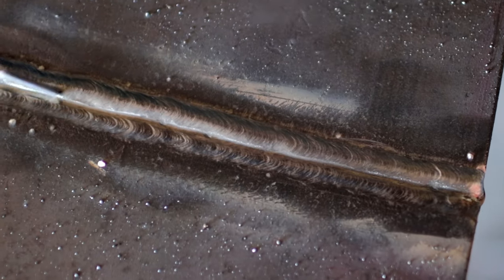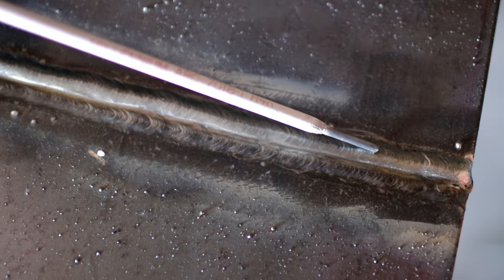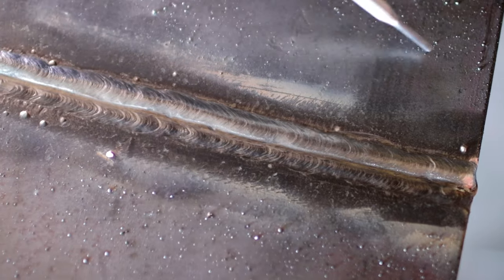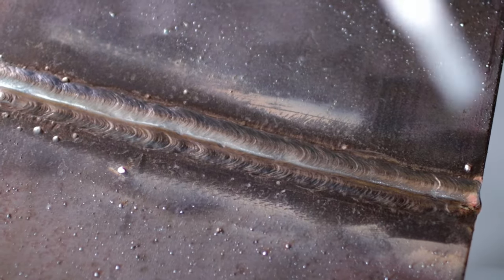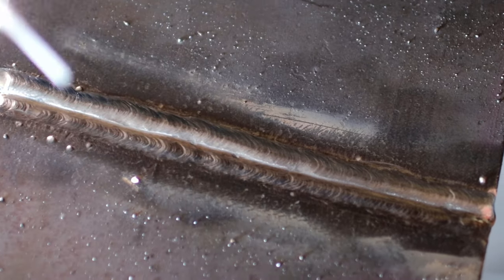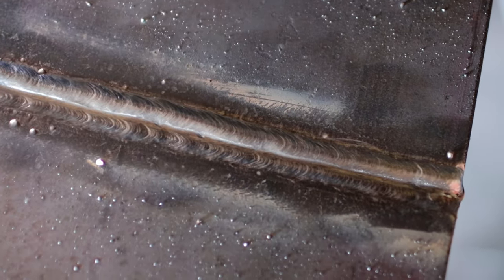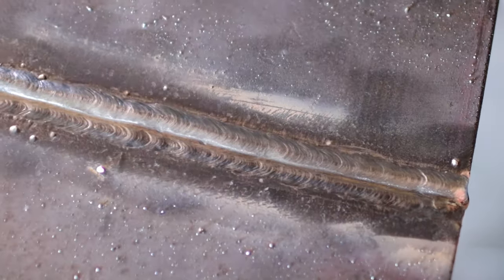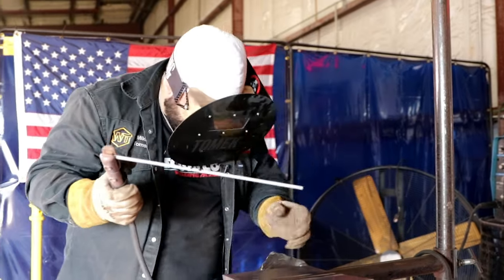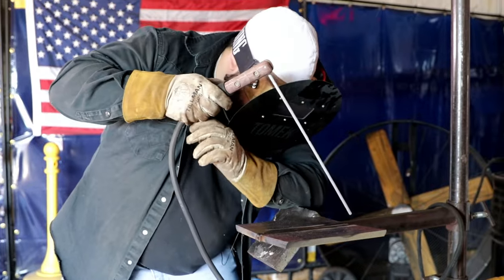So we went through our first bead of the cap already. Now I ground another guideline so I know where I'm placing my rod, so I can go half of this bead and half over here, because remember, you've got to stack your beads 50-50 in order for them to be correct and hold at the strength they need. If you do 70-30 or 60-40, they're not equally balanced. You've got to do 50-50 whenever you're coming down the bead. So we're going to put the second bead of the cap on here, and watch it roll over 50-50 of the first bead, all right?